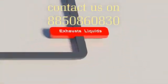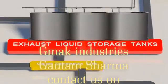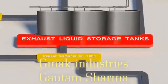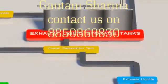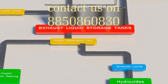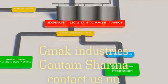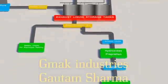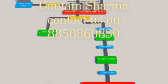All the exhaust liquids collected in storage tanks are passed through three tanks by an overflow system. In the first stage, copper is cemented, which is filtered and collected for further refining. The exhaust liquids after copper cementation are treated with an alkali solution mixture of calcium hydroxide and sodium hydroxide. The resulting metallic hydroxides are sedimented, filtered in a filter press, and then the clear water is discharged to drain.